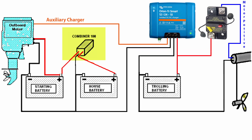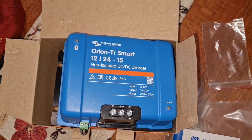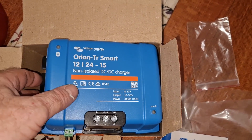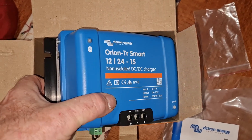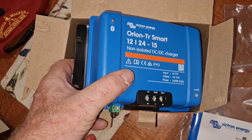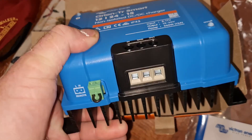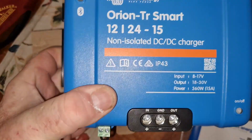The way that works is the primary charging circuit gets used first. The engine itself detects when the batteries are charged and then switches the output to the secondary auxiliary circuit. So my cranking and house batteries have priority to be charged first, and then my trolling batteries get the charge after that. The system works well — I've been using it for a few years with the old installation with the two 12 volt batteries as well as with this new one with the lithium battery.